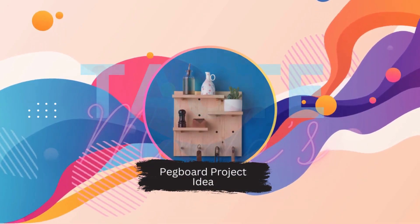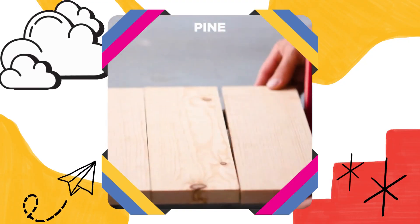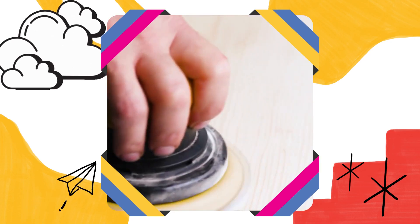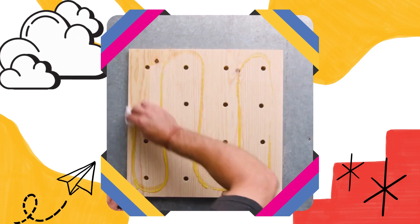Number 11: Tastemate's Pegboard Idea. This hack will make you work with clamps, pine boards, and wood glue to create a stunning pegboard masterpiece. Combine and rest for four hours for the pine boards to dry after gluing. Then smooth the joined board, make a grid, and use a half-inch drill to make the board holes. Finish with mineral oil.